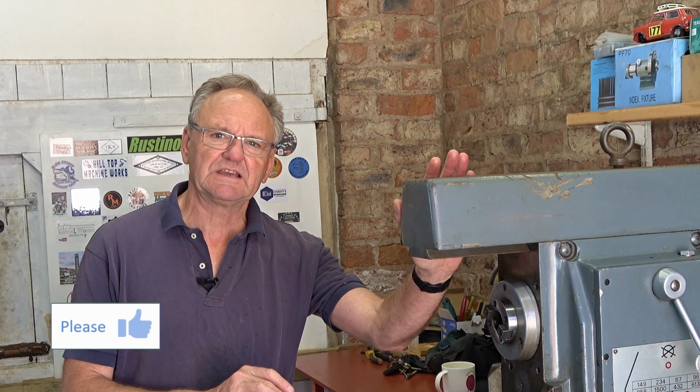In this video I'm doing some maintenance on my Harrison mill. I did a lot of service work on this when I first got it. You probably saw the videos, but I'd never taken this beam off. It was quite rusty underneath, needed doing. I set up a crane, took it off, cleaned it up, put it back on, which you'll see. But I also adjusted the backlash on the X-axis table feed.